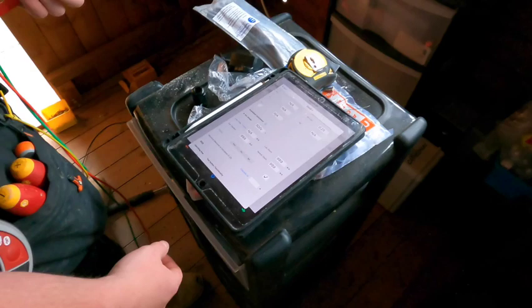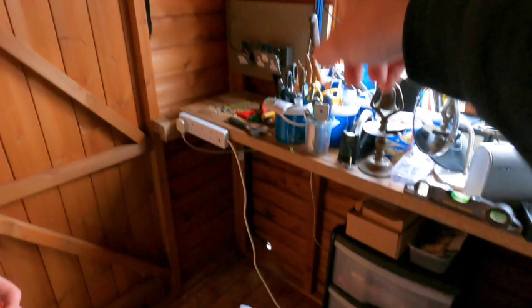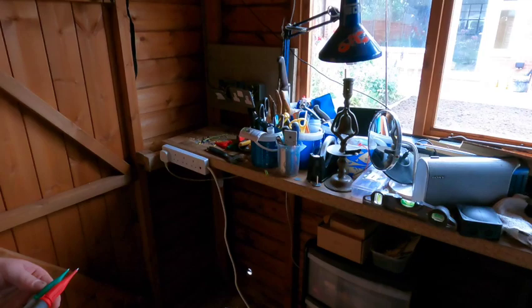Okay, so that's your highest result on the R1+R2. What we now need to do is put all your fronts on, get the light up, and then we'll go down to the board and do our insulation resistance testing.